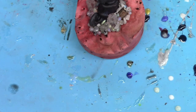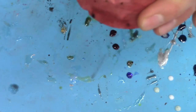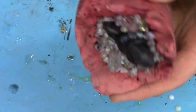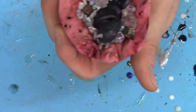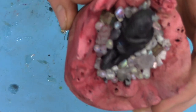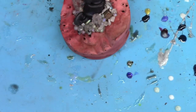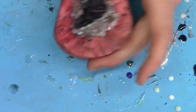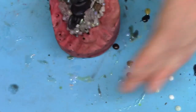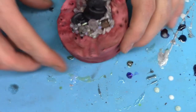So don't get disappointed if you've stabilized something and when it's wet, like when you pull it out of the chamber with your dyed resin, it's looking all super crazy colored, and then you bake it and it turns kind of dull like this. Don't fret, because it hasn't dulled. If I hit this with some denatured alcohol, you get your color back. A nice rich kind of red, darker. All right, so once we hit this with resin, it's gonna really look nice and bold red.